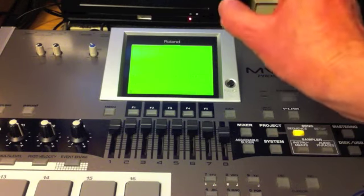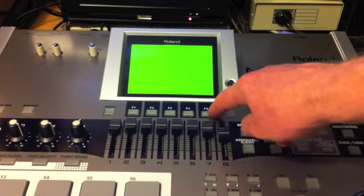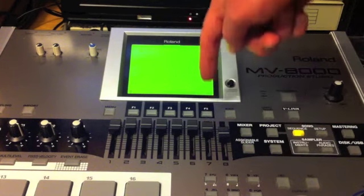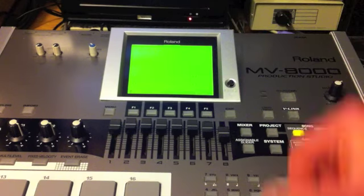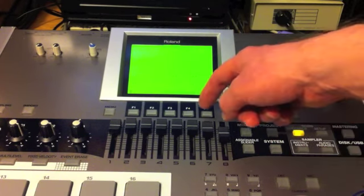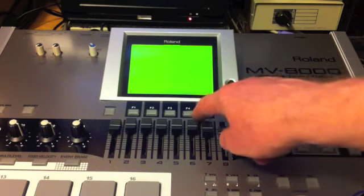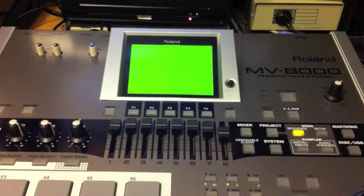And what it does really is just to stop the button from falling off the minute dot of a switch that it sits on, because basically you've got a tiny switch on the printed circuit board, and then this bit of plastic here just has a spindle down the middle of it, and that spindle needs to line up, and once it slips off, it ain't gonna work. So all I've done is used a little bit of rubber to actually go in there and push that back into place. So this has been Fixed It.